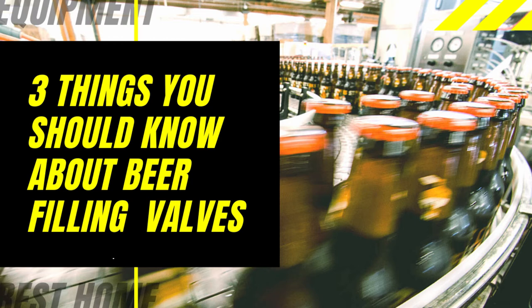At present, most filling machines adopt a rotating structure — the packaging container rotates at a constant speed along with the filling valve, and filling is performed at the same time. The main structure consists of five parts: Filling Valve, Bottle Holding Mechanism, Feeding Device, Bottle Height Adjusting Device, and Bottle Feeding Device. The filling valve consists of a Liquid Tank, air chamber, inflation, exhaust, and vacuum chamber, and the filling container. The fluid path between valves can switch in sequence following the requirements of the filling process. It is a key component that determines if the machine can work normally and efficiently, and one of the key components that determine the technical level of the filling machine.